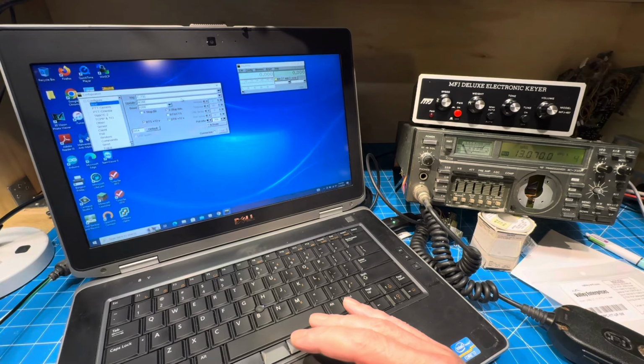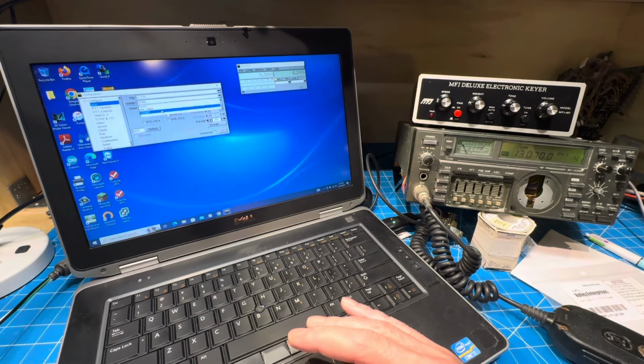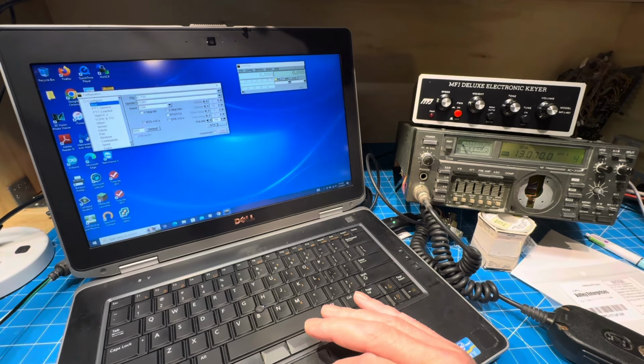And then we will say COM3, at least on this machine, and it sets it up automatically at 1200. It said online somewhere that it should be 8 bits and one stop bit, but it came up with 2. So far that's working. So then I clicked activate.